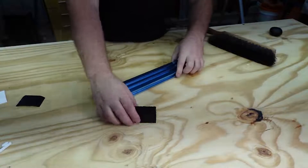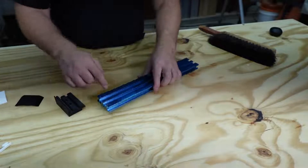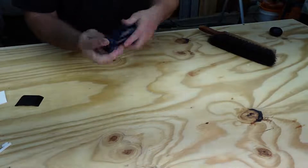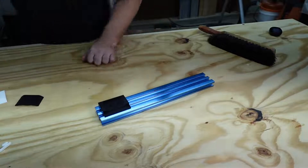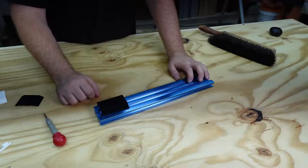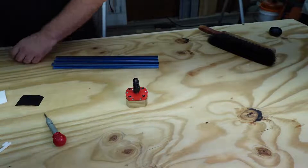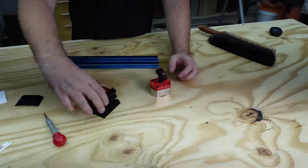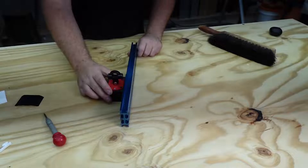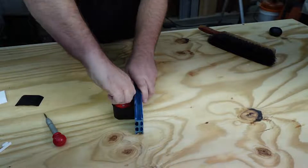For the final design, I went through the bigger part here because it wasn't going to be too thin, and I could screw through the inner side, which is a lot smaller. Once I did that, it fit a lot better. I can use this to set up my marks for the center line, punch it down the side, and drill screw holes so I can screw this in. The design process was very iterative, but the final result is this — notice it slides onto the extruded aluminum just fine. Now we have a magnetic bandsaw fence. You turn the dial on the bandsaw and boom, it's magnetically locked down; turn it the other way and it releases.